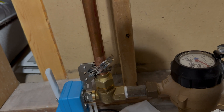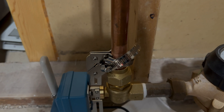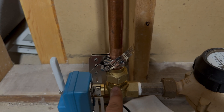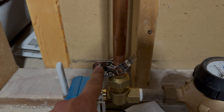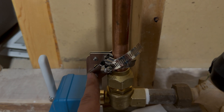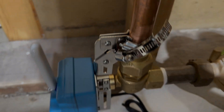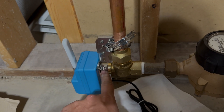So I've got it set up on there. This comes with a couple of different length brackets — I had to switch to the shorter ones. They recommend that if you're on a 90-degree elbow, you spread these apart as far as possible. One is all the way at the top with a straight hose clamp around it, and then the next one had to come down at an angle using the larger hose clamp going around the other one. But it is all tight, and that's really just to provide structural lateral support for the motor to turn the valve.